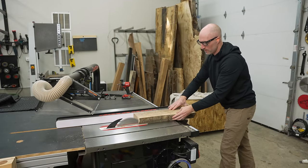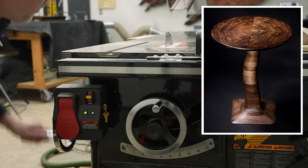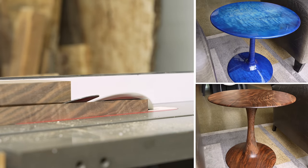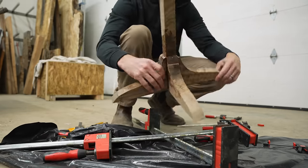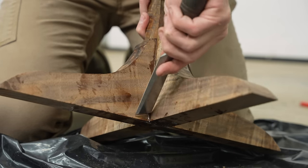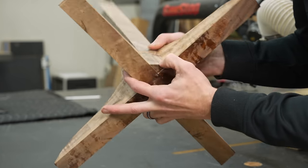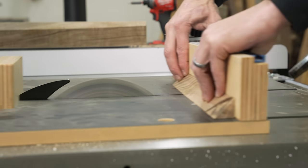Over the past couple of years I've slowly been improving my power carving skills. I still remember my very first table — I still have it in my house — although it was a pretty terrible job on the power carving. But I'd like to think I'm getting better. This step is actually going to make a huge difference: I cut those 45-degree pieces to add a little more material between the legs, which is going to enable a more continuous, flowing look between them.